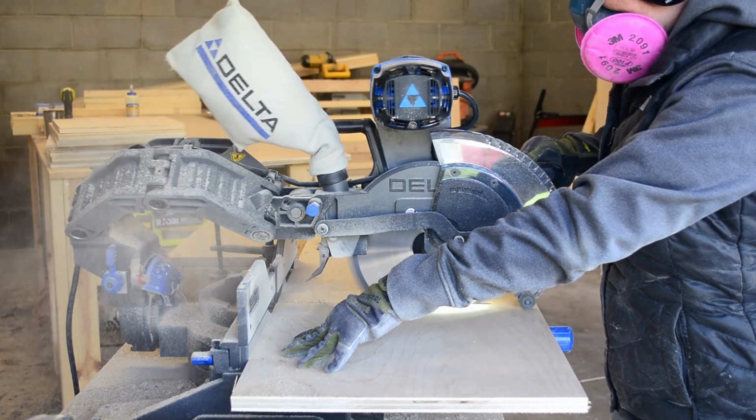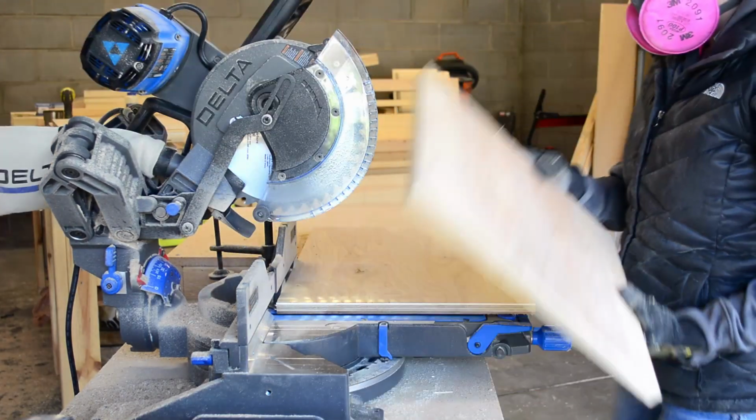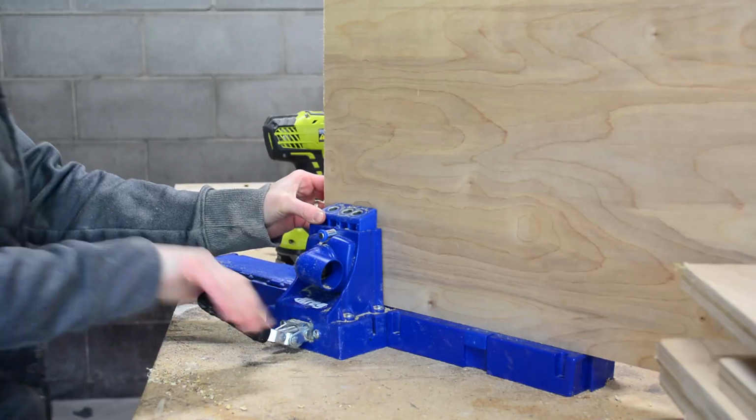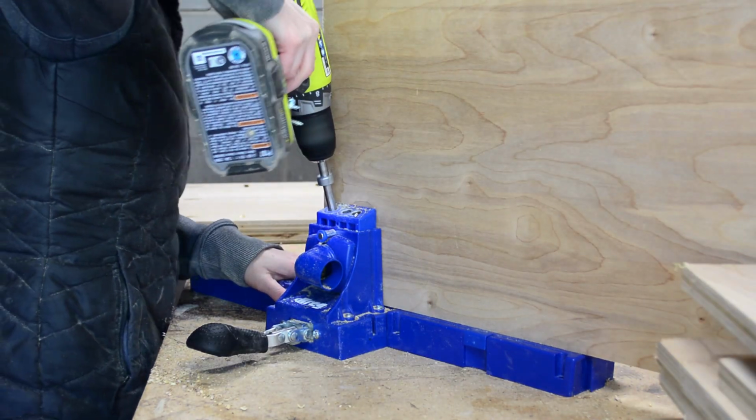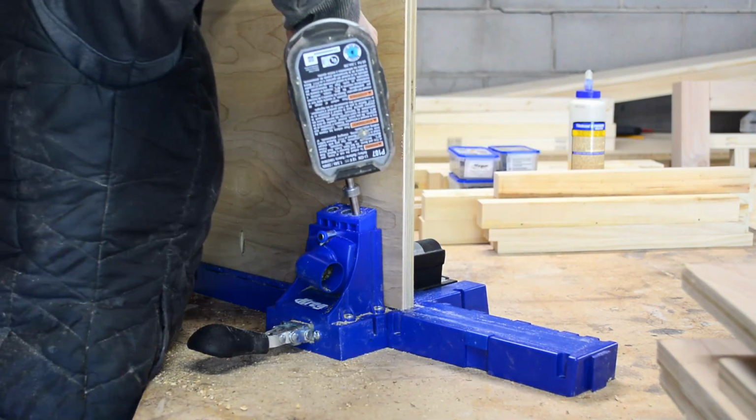The blade only reaches about halfway across the board, so you have to flip it over to finish the cut from the opposite side, and it's pretty tough to get it lined up perfectly. If you're feeling risky, go for it, but the table saw or circular saw with a guide is going to give you more perfect cuts.